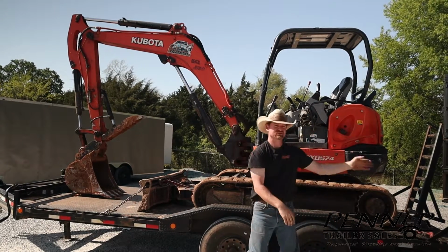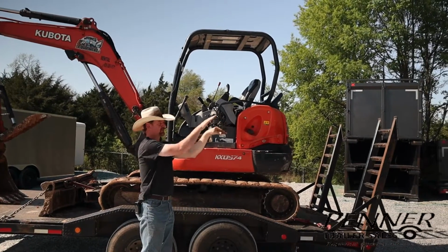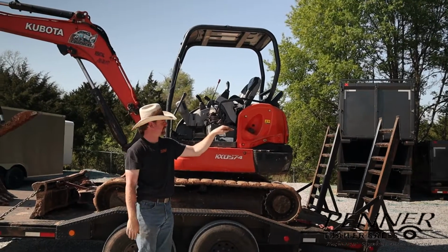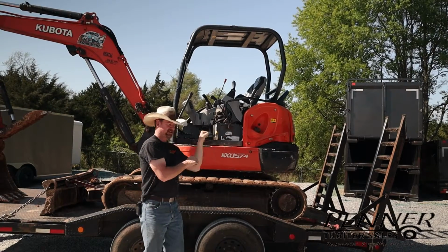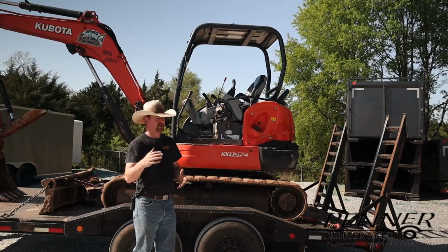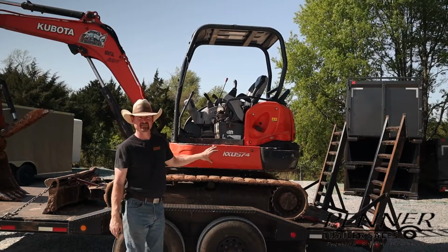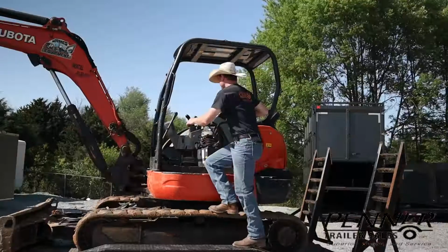Whereas if the boom was facing to the rear, it's more likely to bounce a wire up over it so that it wouldn't catch in case you did encounter that. And if you hit a bridge, it would still wedge, but it wouldn't be quite as extreme of a jammed situation as if you were to strike a solid object. Next here, I'll unchain this machine and we'll move it forward, and I'll have it sitting there as I would recommend, to demonstrate what I'm referring to.